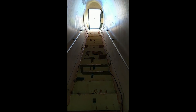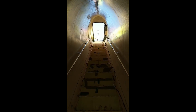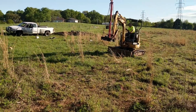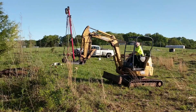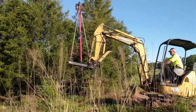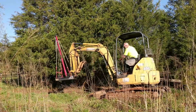We need to get this 15kW diesel up there without tearing it up — that's the job for today. We do some crazy jobs but we have fun. Engineer 775 here — we're on a search and rescue mission to remove a generator and pull a well pump. I gave a sketch to my buddy Brian of something I wanted to try. He went and built it, and we're calling it the high lifter jib — an accessory to a mini excavator. We're going to use it to lift and pull a generator that is 30 feet underground.